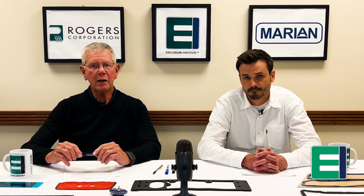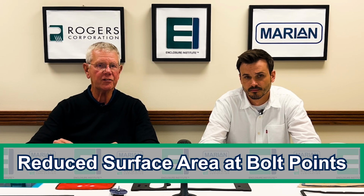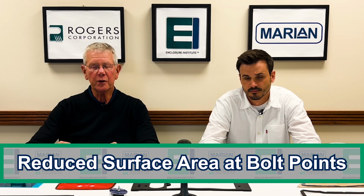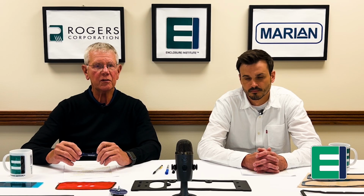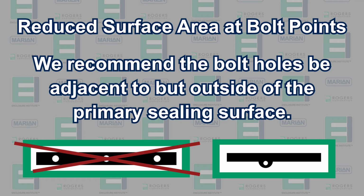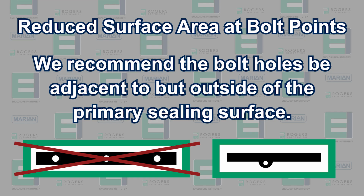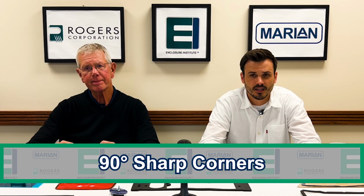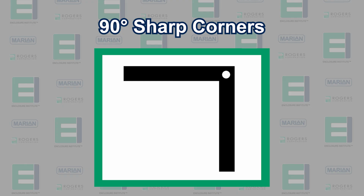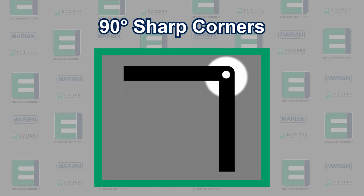Another geometry problem we run into happens when the bolt holes or stress points of the fastening or compression are within the sealing surface, reducing the surface area of the gasket at those locations. We recommend that whenever possible, the bolt holes be adjacent to but outside of the primary sealing surface. 90-degree sharp corners can also cause trouble. After die cutting, these sharp corners in the foam often provide a stress point for a break or a tear. Use radiused corners whenever possible.